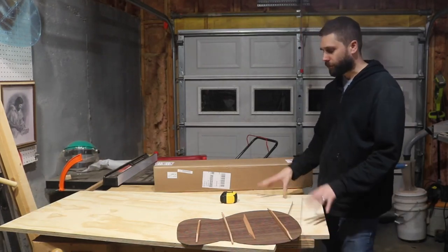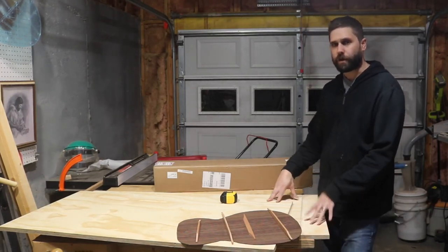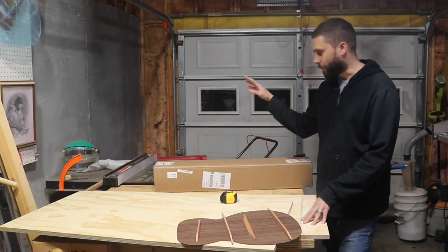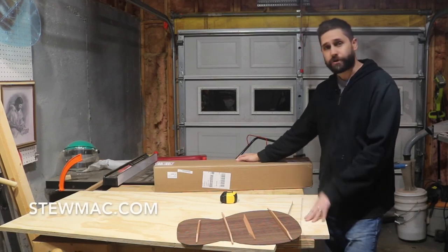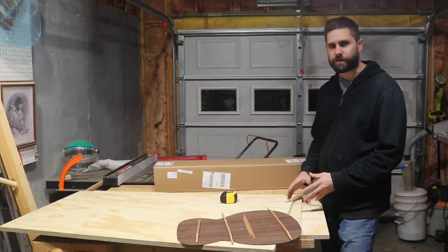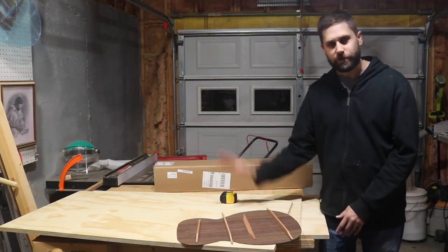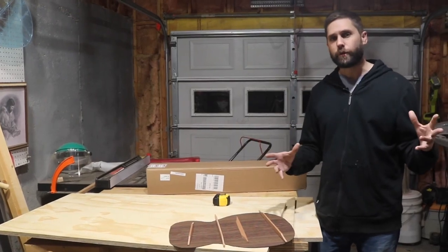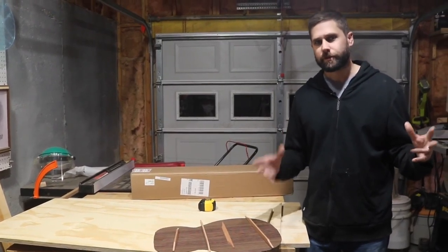What I have to work with is three pieces of two-foot by four-foot, three-quarter inch plywood I just got from Home Depot tonight, and a box of hardware from StewMac.com. I'm going to follow the directions on their website and see how this thing comes together. The first step is to cut all this wood in half so I'll basically have six two-foot by two-foot panels — I'm going to do that right now.